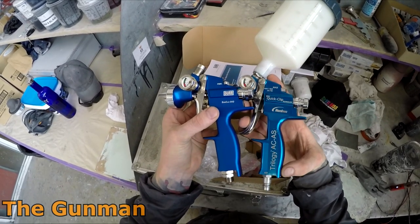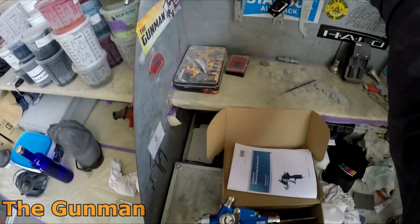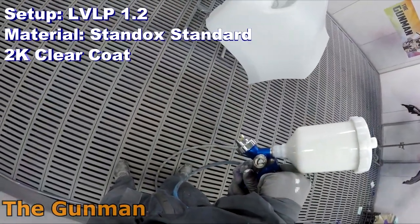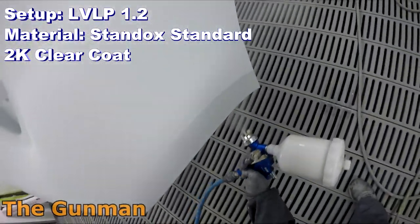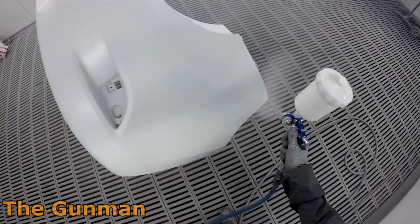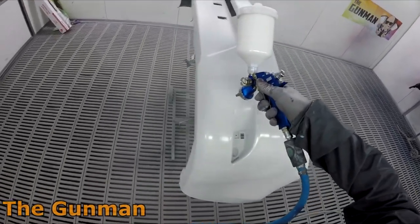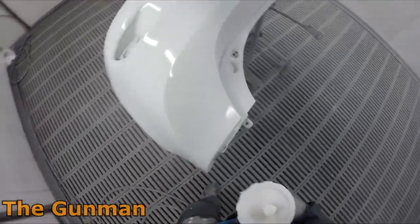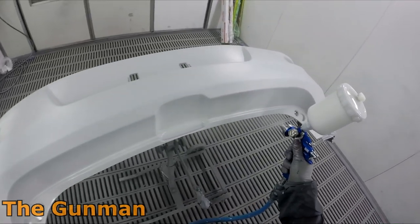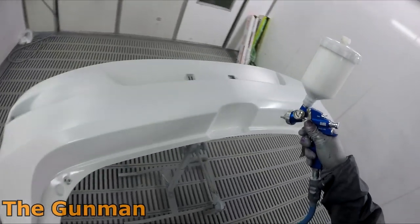Here's a look side by side from the Nordson to the Dürr. I personally think the Nordson does look that little bit better with the shiny body. The base of the Nordson where the air fitting goes in has this little tab that comes down — I ended up having to cut it off because the air coupling on the end of my airline wouldn't actually fit into the gun. At least they've gotten rid of that now.